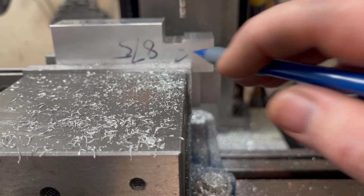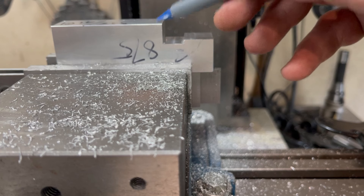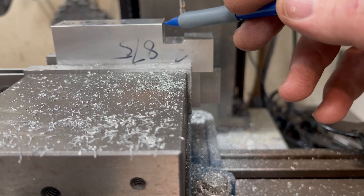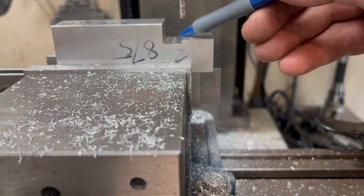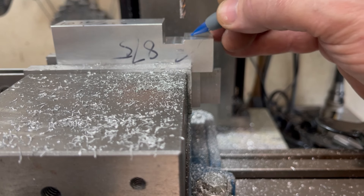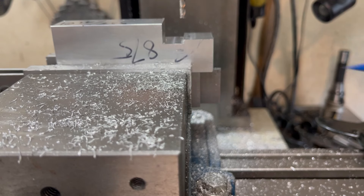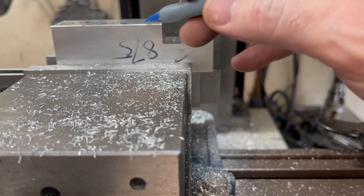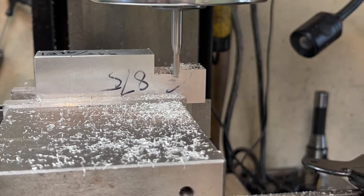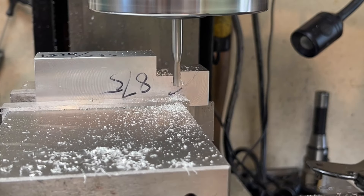I need to create a little flat spot at the bottom of the V-notch, which is the top of the way. I have a little 5/32nd bit in here. I need to go down 0.9 inches from this surface and 754 thousandths over from this surface. I was at 1.216 with a half-inch bit, so that put the center line at 0.966 — so minus 754 that gives 212 thousandths I had to move left to get to the center point of the V. It's quite a lot of stick-out for this fairly thin end mill but I'm taking it fairly slow. I had to worry about hitting that shoulder above with the head of my mill.